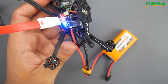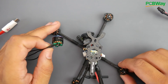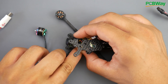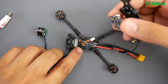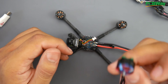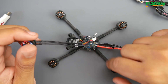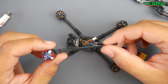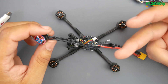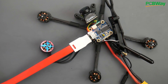Upon visual inspection of the motor it doesn't seem to be burned. If the motor is broken, I have a replacement motor here which we can test. However, take something into consideration before you do anything like this — make sure the motor you're using is okay, because the ESC could burn the motor as well. This is a T-Motor Racer Star set and I got eight of them, so it's okay if one goes bad. I'm going to place this motor in, see if it'll boot, and from there we'll look at the FETs, the voltage dividers, the gate driver, and everything we can possibly see.